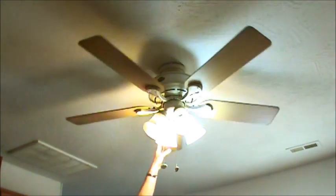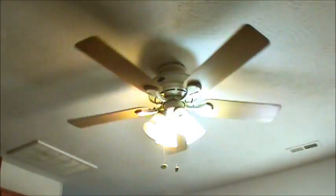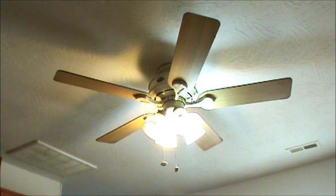Now we're on ceiling fans. In the summertime, looking up at a ceiling fan, it turns counterclockwise. In the wintertime, if you're looking from the floor up, it turns clockwise. In the summertime, keep it on about the second speed. Most people set their ceiling fans for the wrong speed. Remember: counterclockwise in the summertime, usually on low or medium speed. Also, get the biggest ceiling fan you can purchase — don't be cheap, don't buy the little three-blade fans, they're junk. Get a 52-inch fan. I usually get Hunter ceiling fans; for my whole house they make no noise whatsoever and don't vibrate.